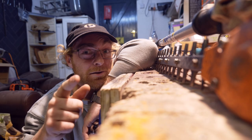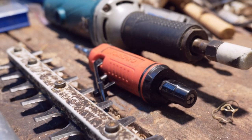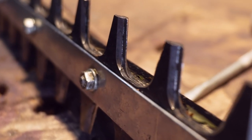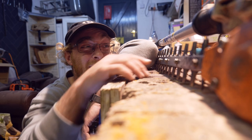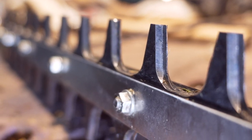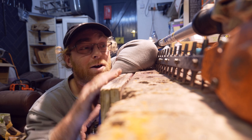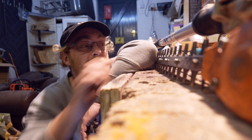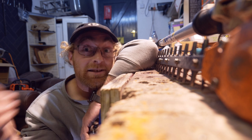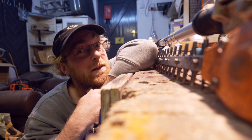However, for this, we're just going to sharpen what we can get to with a die grinder. You could use a Dremel, but mine's out of action. Those corner bits — I'll show you where they've still been sharpened to. You probably want to sharpen a little bit lower than that, in fact. But if you're using a grinder, you're not going to get that low without hitting the casings. So if you need to do that, have a look at the next video. But if your corner bits are all right, you can probably get away with just doing this.